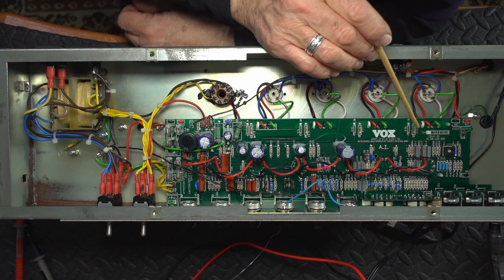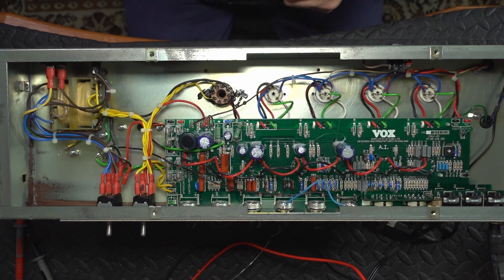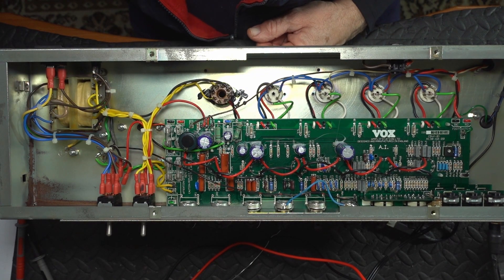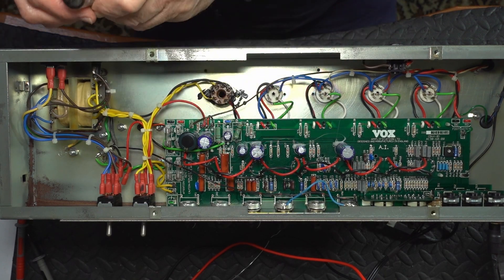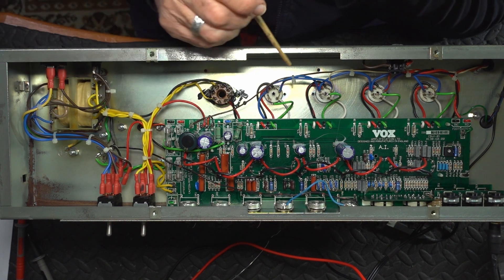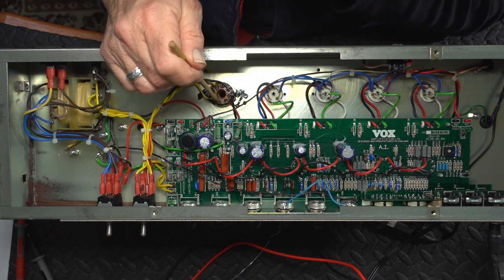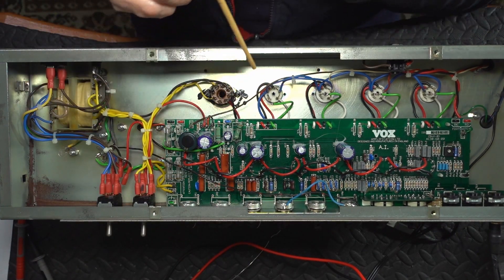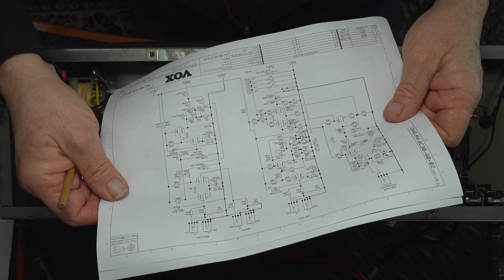We now know that 100 ohm is just too low a value, and I will probably replace these with either 470 or 1K — that'll just make their life a little bit easier. I did test all of the tubes. One of them flunked out and they look pretty old; I wouldn't be surprised if they were the original tubes. I tested the GZ34 — it's fine. I also tested all of the pre-amp tubes. They're all 12AX7s, except for one in the vibrato circuit.